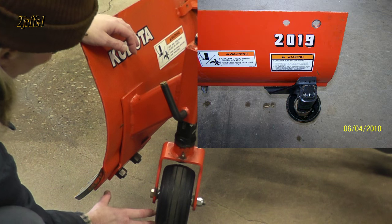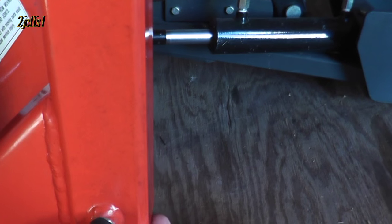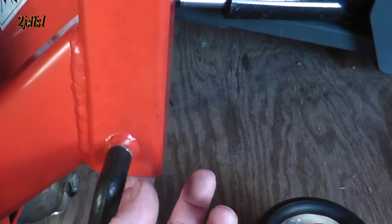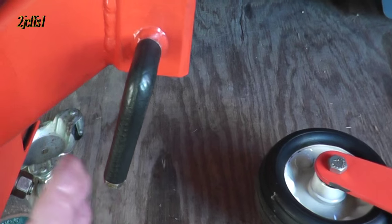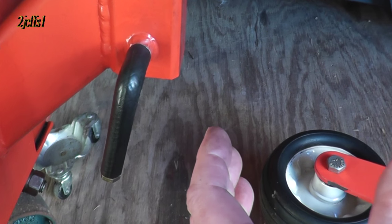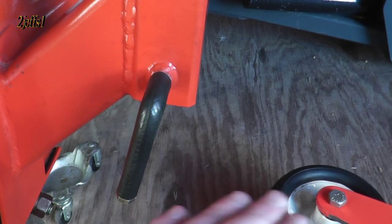This piece right here — you want the skid shoe mold. The square tubing I used here is two-inch OD and one-and-a-half ID, so it's a quarter-inch wall thickness. The most important part is to have this totally vertical; otherwise, when you back up and go forward, the wheel movement will raise or lower the plow. If it's totally vertical, the plow will stay perfectly at ground level.